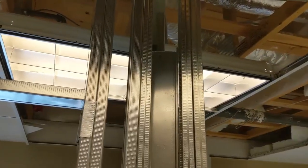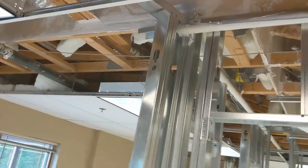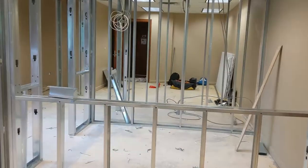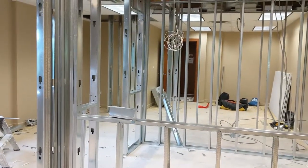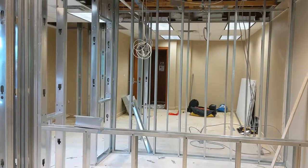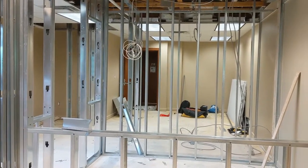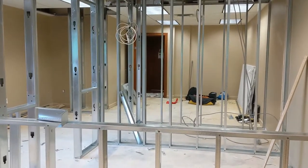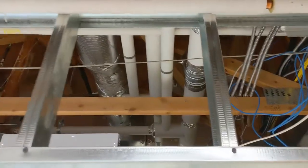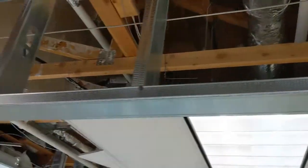Tomorrow the electrician is coming to run some wire and the plumber, so it's all gonna look good. This place is gonna have a lot of windows — was a little bit more extra work. The window height is gonna be 48 inches, we have them at 49 and a half, because we're just gonna put a wood trim around it — three quarters on each side — so that makes an inch and a half. And we just had a few little obstacles like pipe on the way, so we just had to cut around the studs to make it fit good.